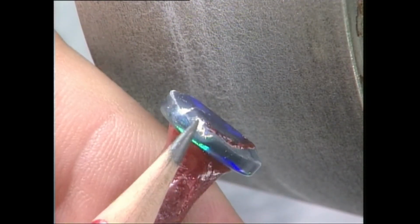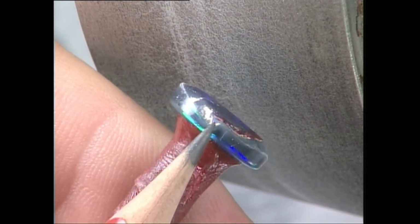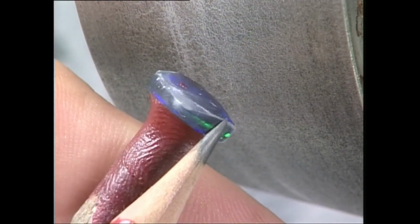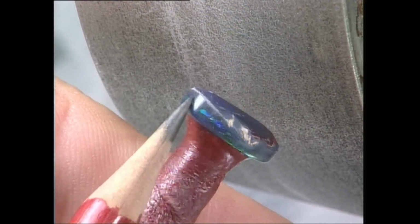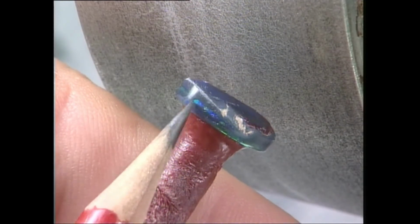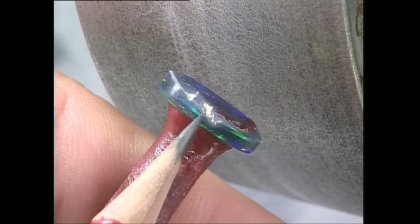You can see this point here, where the divot is, well, our setting edge will have to be in that region there. We'll have to come down to that all the way around the piece. So we'll basically end up right down here near this colour bar. Because of this area here, we don't have a choice. That's where our setting edge will have to finish.